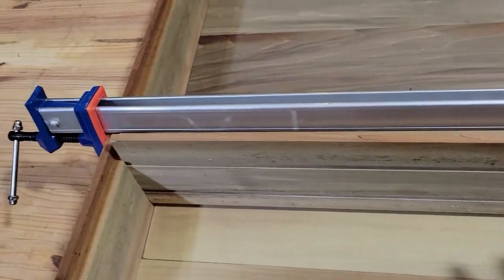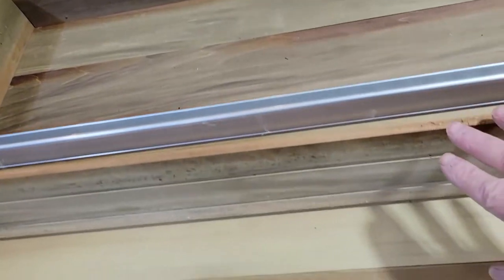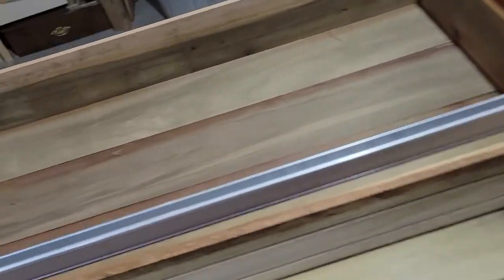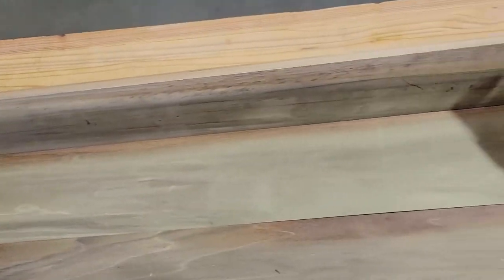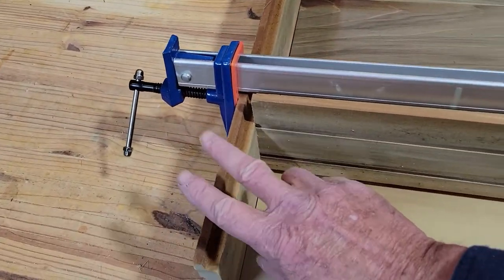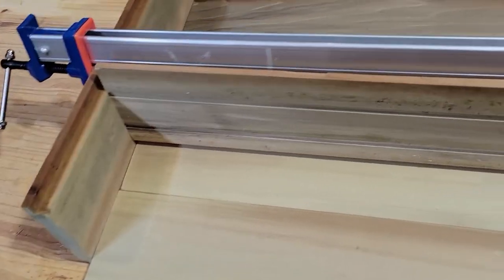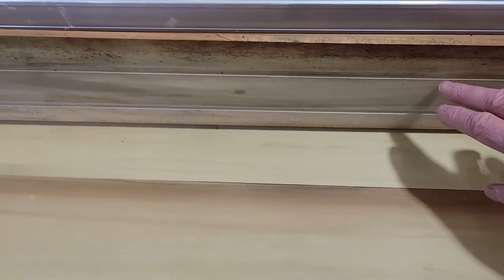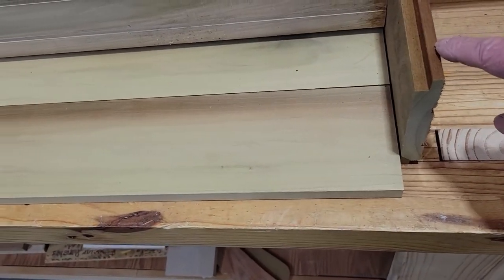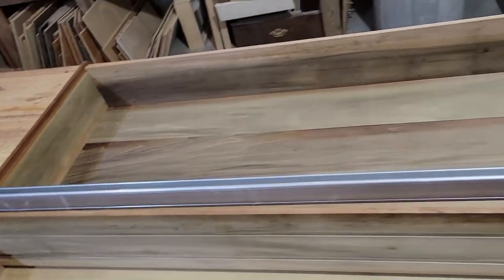I've got these kind of set out the way I want. I need three four-foot pieces - one for the top, one for the shelf, and then a spare one we'll use to case in the middle. I want this to be two feet tall, so we'll do two foot on that. We'll trim it off when we get the final dimension. Since it's got grooves, I'm going to take and just plane that down, get rid of the grooves, and remove the tongues and lips. I'll be running them through the saw and the planer.